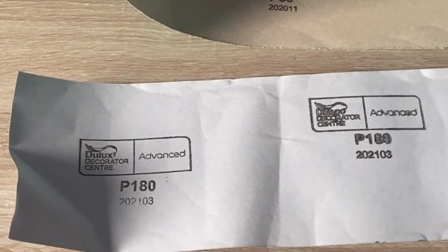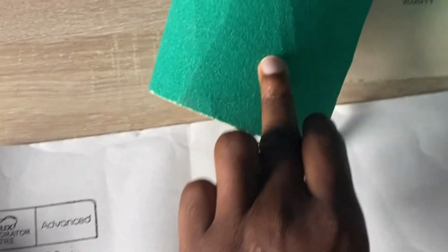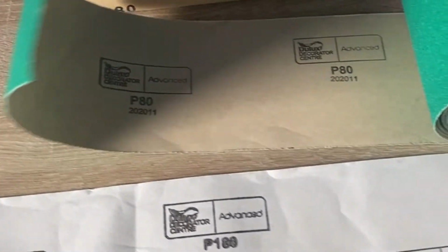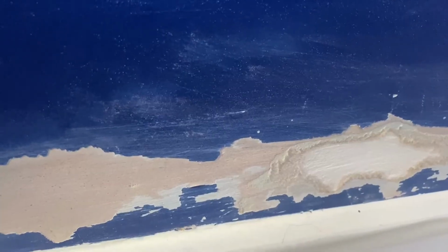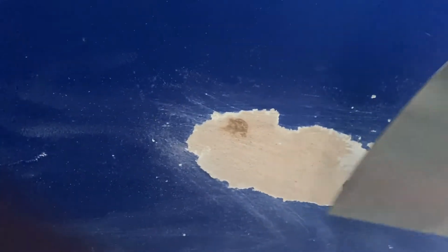And whilst sanding, I've ensured that I've used my face mask, because the process of sanding involves the removal of material, it creates airborne dust that may be carcinogenic. As you can see, I ensured that I used my dust mask whilst sanding the wall. And as you can see, it looks clean and smooth, and I've trimmed away any frayed drywall edges from the hole.